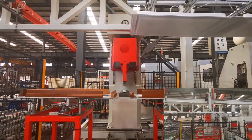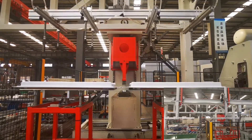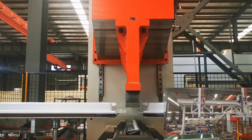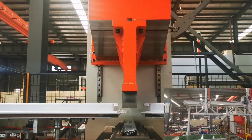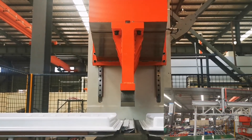The cutting device is only used for multi-cavity molds and can be bypassed when there is a single cavity. A table moves in and out of the blade by cylinder. The blade is driven by a servo motor to control the cutting dimension. A strong reducing motor drives the wide blade to stamp down and cut the middle joint.